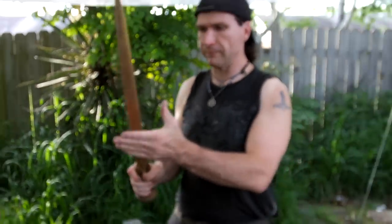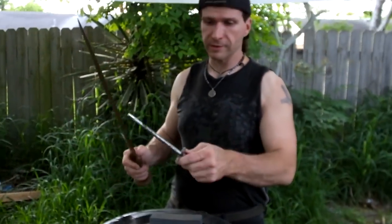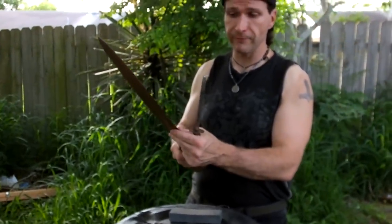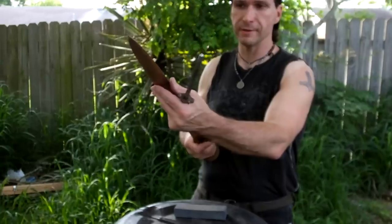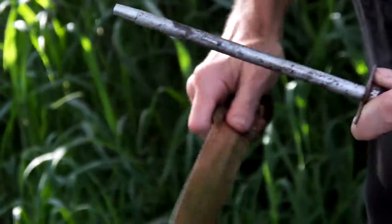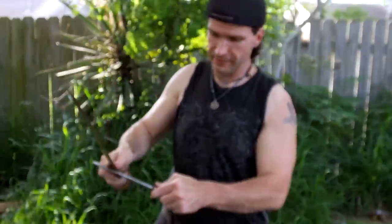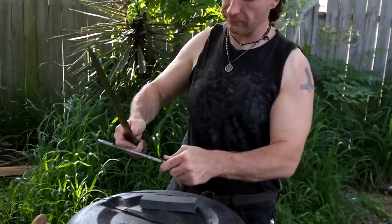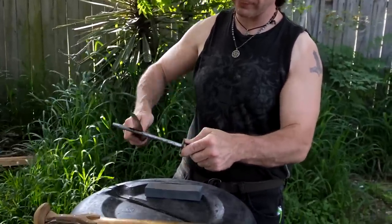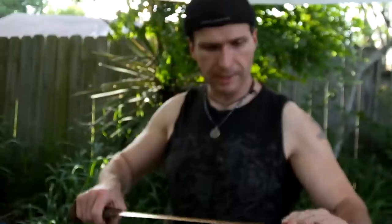With bronze, we don't want to sit here and take a lot off — these are already relatively sharp. One of the things I do that Neil was interested in is using a steel. I used to work in a butcher market. A steel gives you more of a razor edge and also helps fix your edge if it gets folded, because microscopically the edge is like saw teeth. Drawing it across at the exact same angle keeps them perfectly aligned. It also helps straighten the edge, especially on a soft metal like this. This is an older, softer steel — you can get really expensive hardened ones, but a softer old steel like this works perfectly. And what it gives you is this beautiful edge that shaves, as you can see with hair coming off.